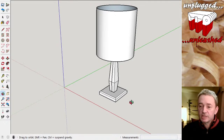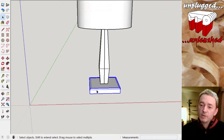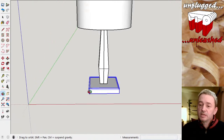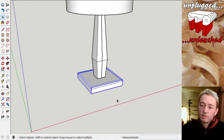Hopefully that was a bit interesting. I'll show you how I'm going to make these various pieces — I said I'll be using wood just from a DIY store, so we'll be looking for something which is probably two-by-one, and we can glue three sections up to make the base. We may need to go a little bit larger — maybe three-by-one — glue them up and then plane to exact size, because boards from a DIY store are nominal sizes so a two-inch board will be a bit less than two inches.